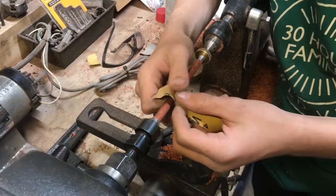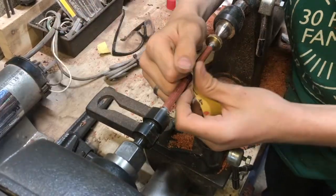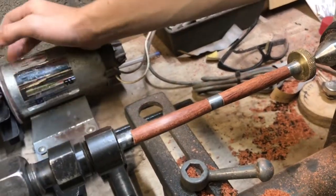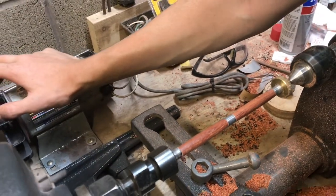And now for the final 2000, I'm just going to end with grain side to side. I'm not going to give it a final spin. This would be the point where you double check it for the last time. And if you were doing a mineral oil finish, this is where you'd stop, put the mineral oil on and it'd be done.